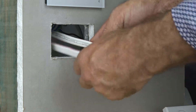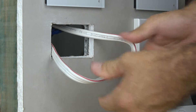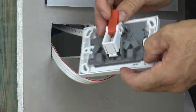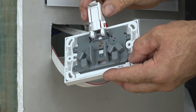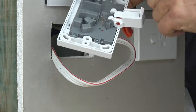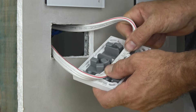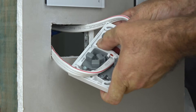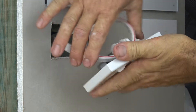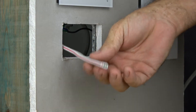So when you grab the cable, don't be scared to bend it and twist it flat — that's what we need. We want to make sure that both the housing lever and the cam lever are fully open, and identifying the active for polarity, laying it flat in its guide, rotating the first cam lever shut, the second cam lever shut, then bending the cable back and putting it back into the wall.